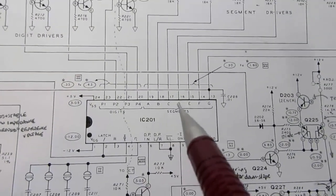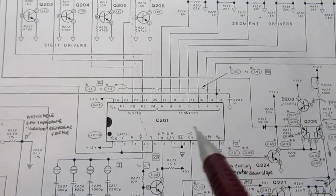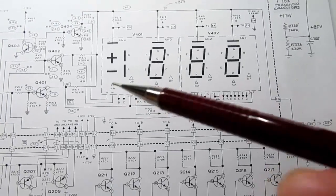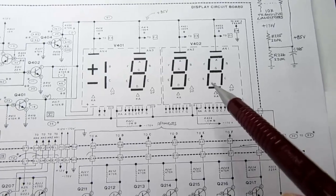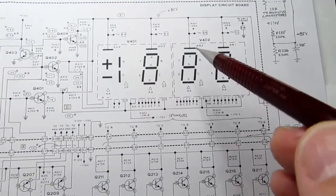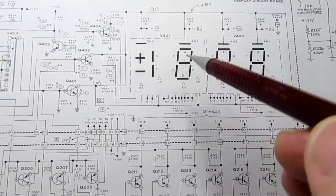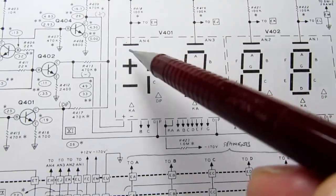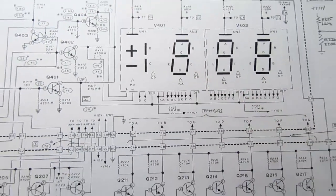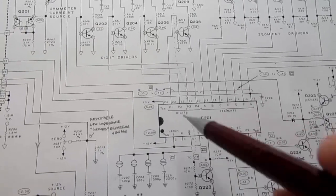So the IC knows which pattern has to be appearing on each of the digits, and they're all in latches in here, and it goes through one after another, starting probably with this one. Maybe it goes the other direction. Let's say it starts with the right-hand side and goes left. It'll output the pattern for that, and then tell another circuit that we're only going to power this digit. Then it'll turn that off. It'll power this digit and turn on only the segments for that digit that should be on. Then it'll turn it off, power this one, turn on the segments for that, and then finally turn on this last thing, which all counts as one digit. So then it turns on the appropriate patterns here. That's the essence of matrix scan displays, and all of that logic and timing is done as part of this IC.